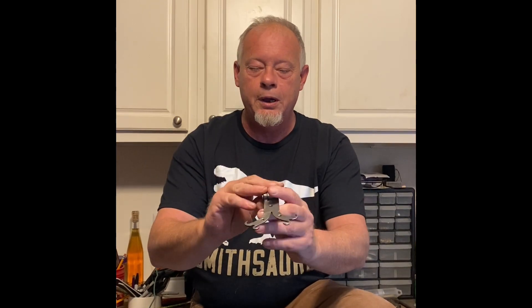And it works just like a hinge. If you're still here, well, God bless you for sticking around through a miserable video. Here's our finished product. Needs a squirt of oil, and really should warm it up a little bit with a propane torch and put a little wax on it — that'll help lubricate the joint too. All in all it's not terrible for having been forged out of a piece of junk that was lying out in the weather for God knows how many years. My hinge joint should be a little tighter — that's my mistake — but not too bad for not having made anything like this in years. Thanks for watching. God bless and have a Merry Christmas.